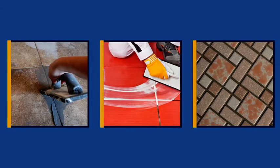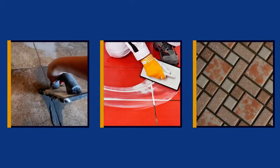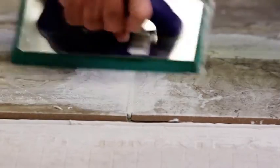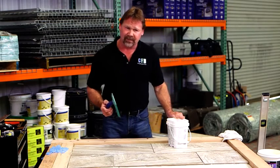After all your tiles have been laid and your thin set has dried for 24 hours, it's time to grout. Grout is available in a variety of colors. Your Floor Trader sales associate can help you choose. Always mix according to the instructions or simply purchase ready-to-use grout. Apply the grout into the joints using a rubber float, moving it back and forth and diagonally. Be sure to remove any excess as you go along, but remember, don't grout the 1/4 inch expansion gaps.